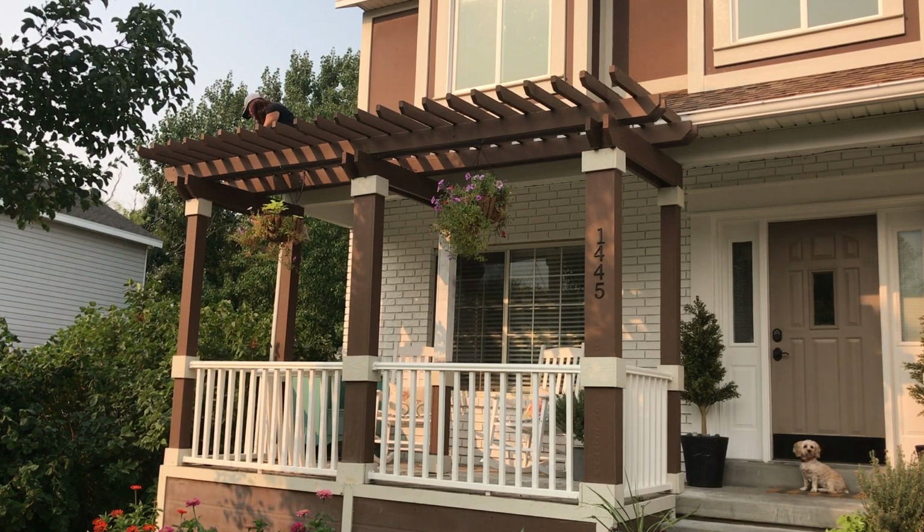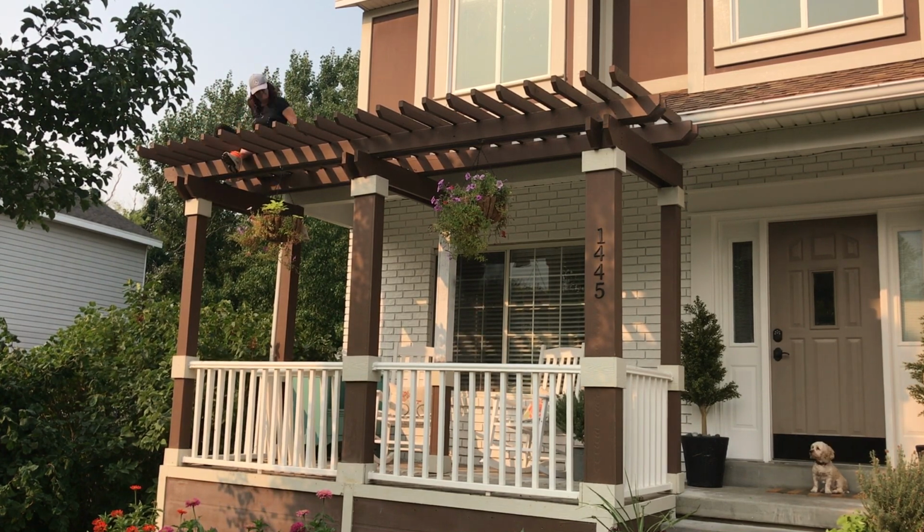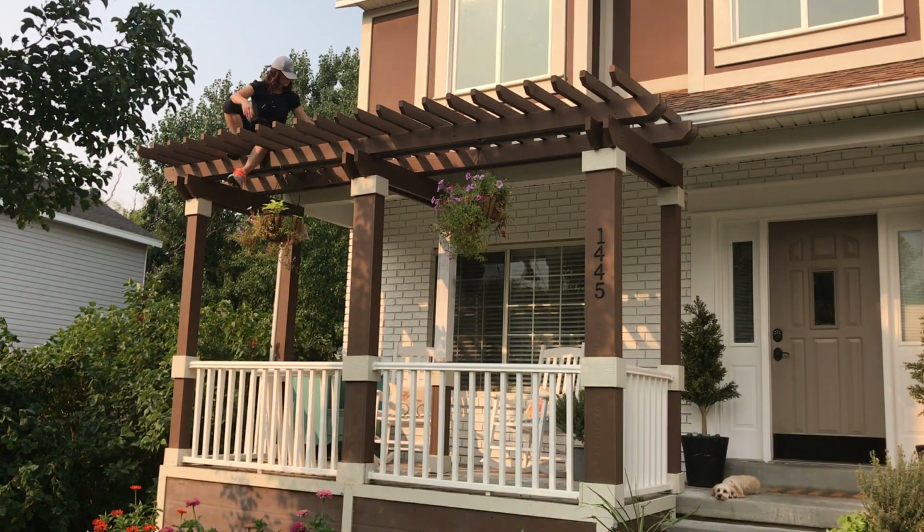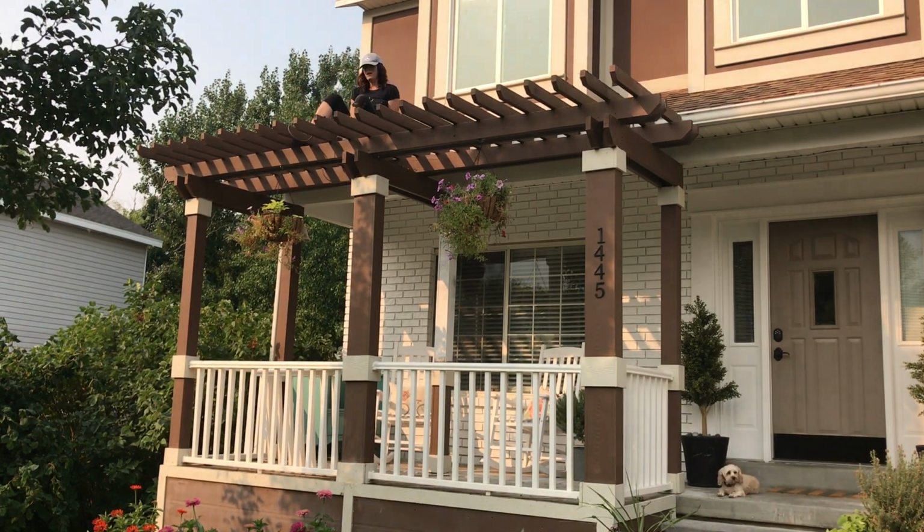Once the wood was dried out, I used my orbital sander and 100 grit sandpaper to sand the remaining loose paint off. Since we are painting latex over latex, it isn't necessary to get all of the paint off.